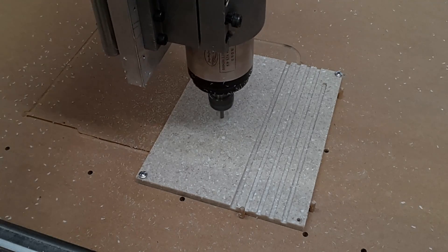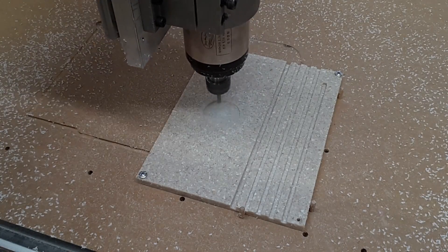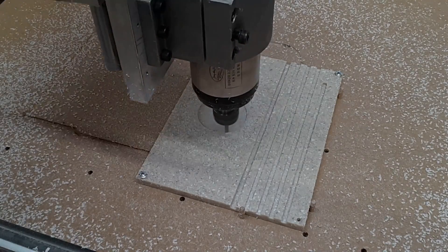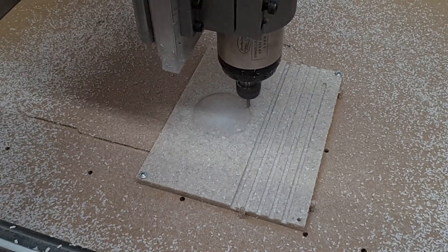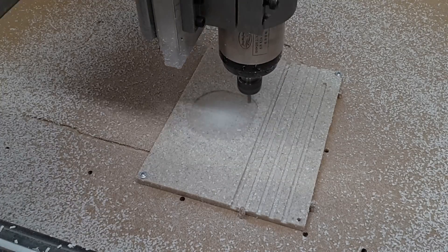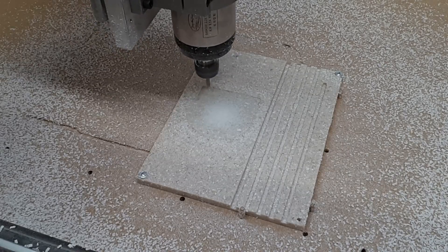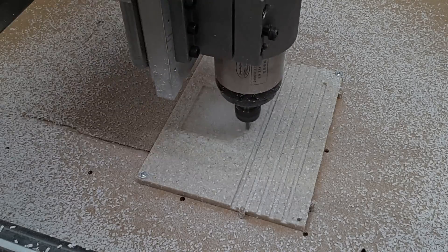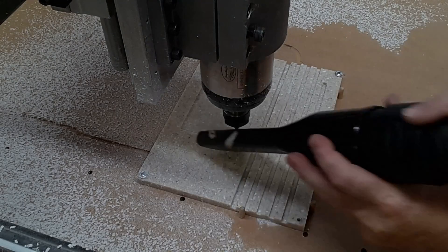You're still here — hence some gratuitous footage. I threw together a quick little piece, looked like a coaster when it was all said and done. I took a hundred-thousandths depth of cut and cut a big open flat area using a quarter-inch two-fluted end mill. I wanted to see how much improvement I'd made getting rid of the stair steps. Suffice it to say, it did really well. The bottom is extremely smooth — you can see tool pathing but that's to be expected with anything. The stair steps are essentially gone for all intents and purposes. So from here on out, periodic checks and tuning are all that will be required.